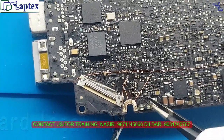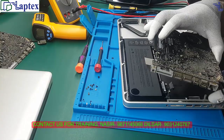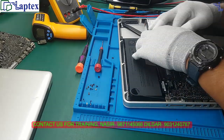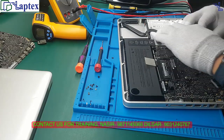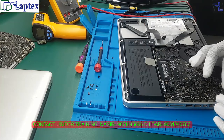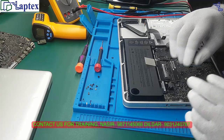This is the work I have done for the LVDS backlight enable. I think the display would have come — let us check it. I made the voltage divider by myself. I did not look at the diagram for the resistor values; I just calculated that I needed 4 volts or less. The original was around 300K ohm and 140K ohm resistors. Instead, I used 100K and 47K and in this way I got 3.3 volts, which is enough to switch the P-channel MOSFET.